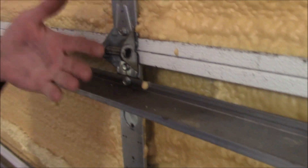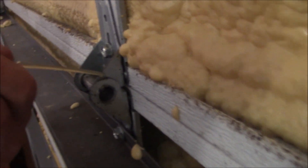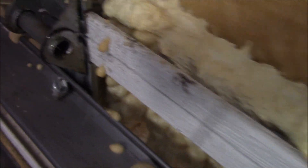The door's got hinges — this is a pivot. When the door comes up, it's a pivot. So I put just a couple of drops on each side of every hinge, because that's a wear point where when the garage opens and closes, that hinge is turning. It needs some oil.